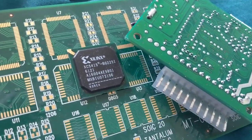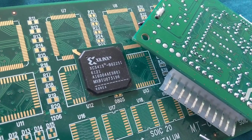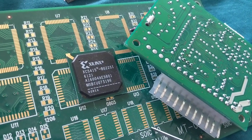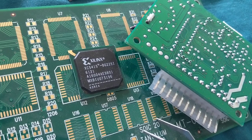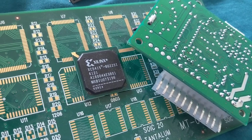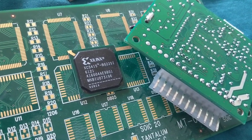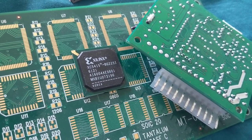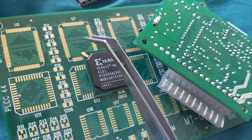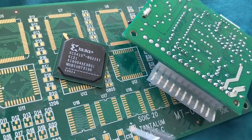Just like on a ship, when we had a contract for a backup generator, it had to pass a vibration test. That vibration test took a whole, there were multiple layers of PC boards, many of them. It had to take a weight of 500 pounds to hit that. And still, that board had to be intact. All those boards had to be intact because it was going on a military ship. It has to withstand a torpedo and things like that if it's a military contract, which means it has to withstand a 500-pound weight. And believe me, many times it broke into pieces. Just like a car has to withstand this, but within limit. The components coming up in the future, the BGAs and all these, cannot withstand everything.